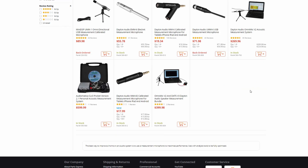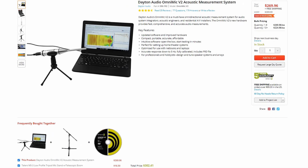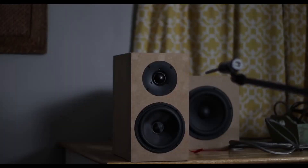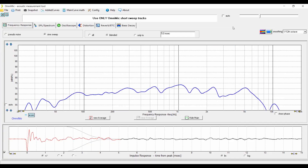You can change that frequency and scale to whatever sounds best. If you really get into DSP, you're probably going to eventually want to get a measurement microphone. If you're going into business selling these kits, I'd highly recommend something like the Dayton OmniMic; otherwise, take a look at one of the hobbyist microphones. Either one will let you see the actual frequency response of the speaker after you program the board, giving you a major advantage to get the response as linear as you want. This program can allow you to get a speaker much more linear than passive crossovers typically allow.